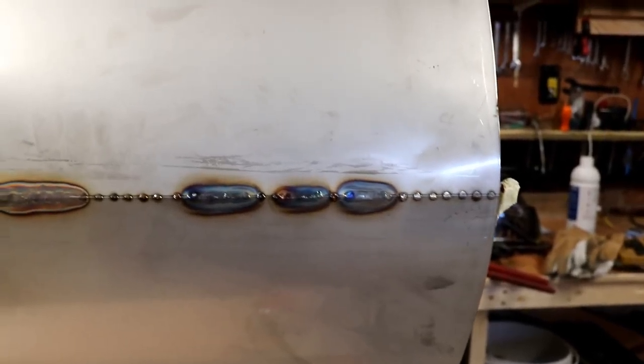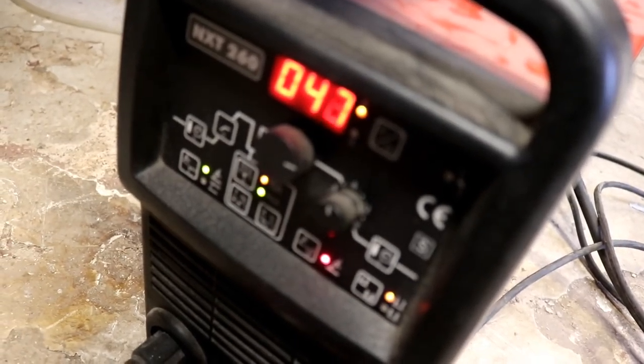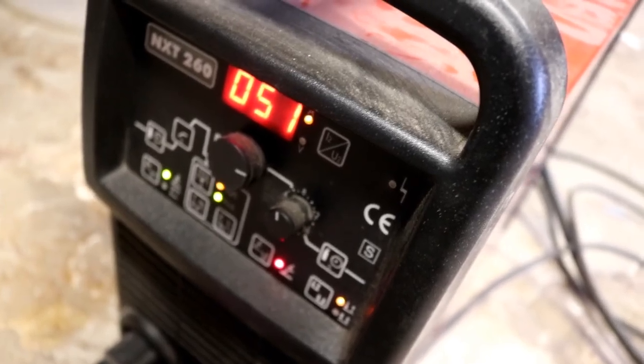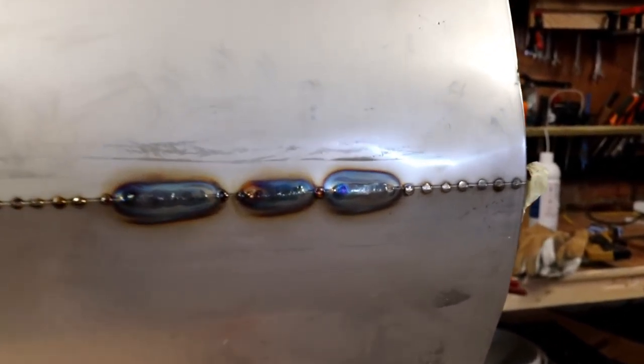In order to improve my welding skills, I've been playing around with the settings on the welder, and I've incorporated some pulse into the weld bead. I tried a few different things on here, and you can really see with the difference in colouration what seems to have worked and what seems to not have worked. So this weld here — one of these was just how I was welding yesterday, about 40 amps, full pedal, and then just chasing the puddle down the seam. Then I thought, right, I'll play with these pulse settings. So these blue ones here, I had them set at 51 amps, 20 pulses per second, with a background amperage of 30%, and they don't look too bad — there's a bit of blue in.